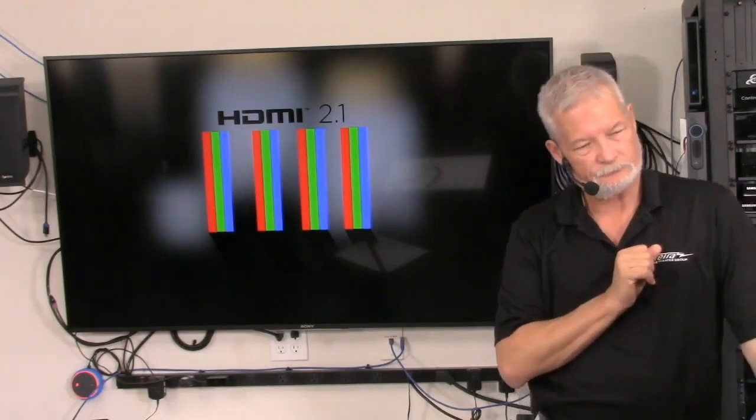So, Brent, what are they doing when they're merchandising the fact that they have 24 gigabits per second? Well, 24 gigabits per second is a valid, testable statement. When you look at, for example, our VLOX Passive, our VLOX Active T-Series, our MHX cables up to 7.5 meters, our MHY cables up to 15 meters, all of those cables have been resubmitted to DPL to validate 6 gigs per channel by 4 channels. So we know that the cables are absolutely capable of that.